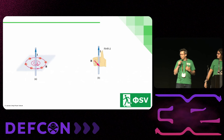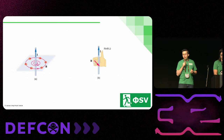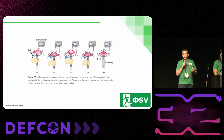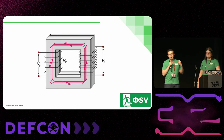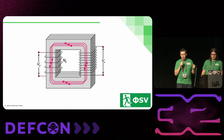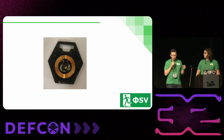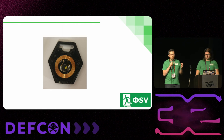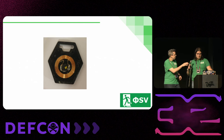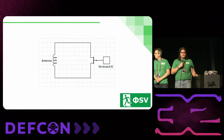It's basically a transformer that you're making when you bring your card up to a reader. The reader has a coil of wire and passes an electrical current through that coil at all times. As the card approaches, we're completing the circuit, and the magnetic field around that original coil induces a current in the coil inside your card. That powers a little chip in there that allows it to respond to the reader with its ID.